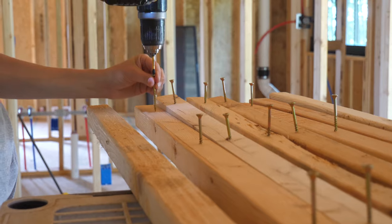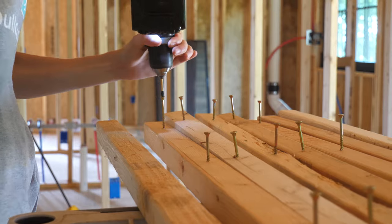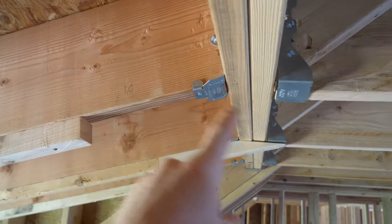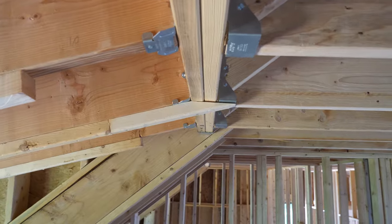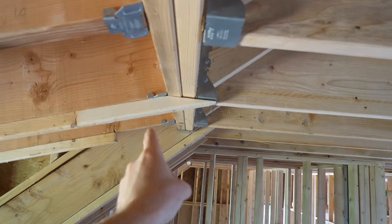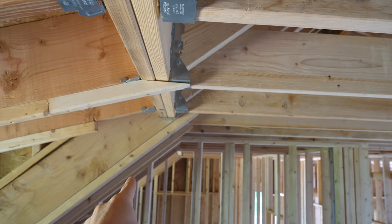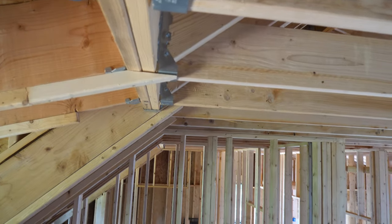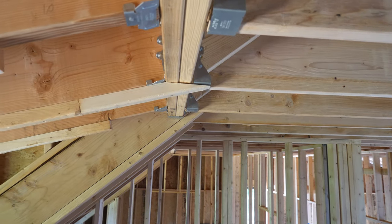Elena got all the screws started for me and then I hung each strip up. The part of the ceiling where the dormer meets the flat ceiling, which also meets the 10/12 ceiling, is a little bit tricky. But luckily it just so happens that an inch-and-a-half furring strip with this double header offset lands at the same place as the inch-and-a-half offset on the 10/12 pitch right there. That point meets with that point — sort of planned, sort of unplanned — all I can say is I'm happy it worked out.